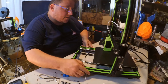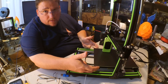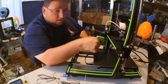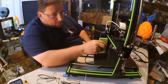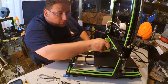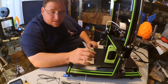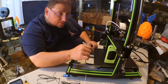Okay, it homed and I tightened all four leveling screws all the way down. I raised the axis up to right around 100 millimeters. I got an iPhone 5C here, and the belt runs underneath here. So you gotta put it in over here and then slide it over. Make sure you have the right height. Doesn't matter what the height is, as long as it's the same on both ends. That's how you level your gantry.